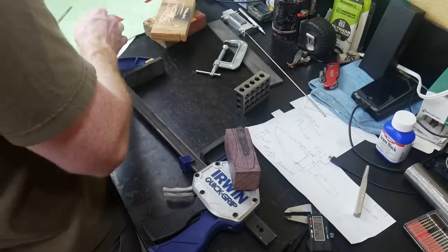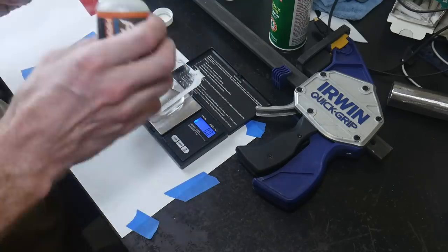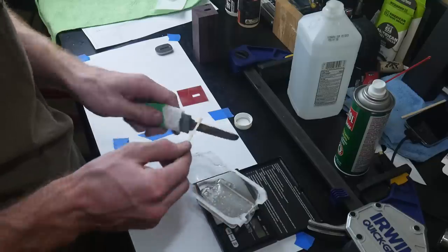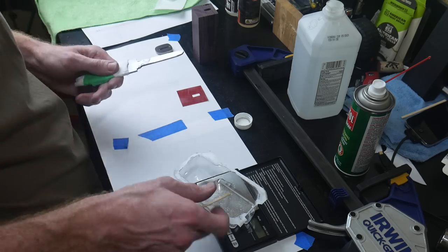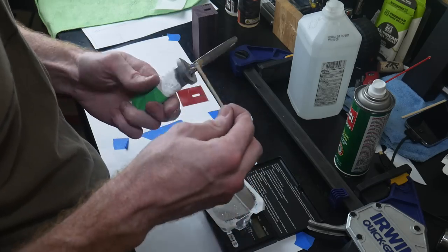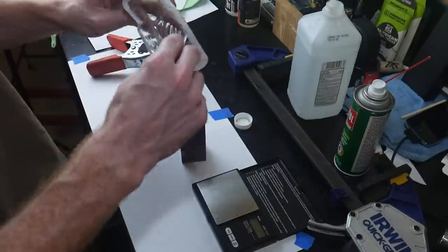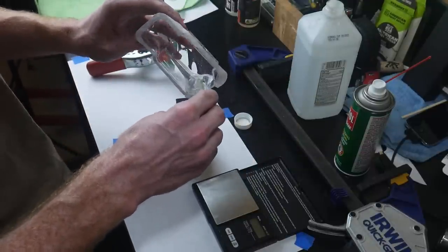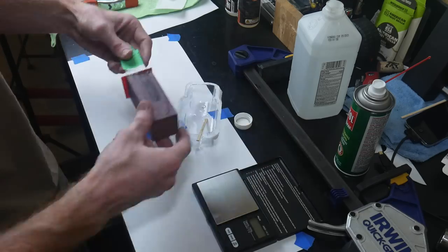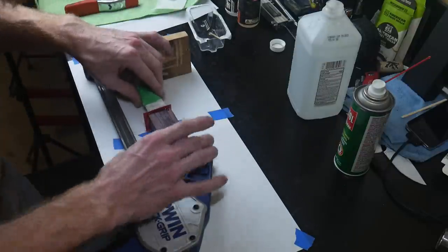I made sure that the front of the handle material is flat and then test fit the whole assembly so I'm not running into any surprises during the glue up. For the glue up, first make sure all of your surfaces are clean — I'm using alcohol; you don't want any oils to affect the adhesion of the epoxy. I put a little bit of epoxy on the tang, slide the guard on, then add a G10 spacer between the guard and the handle material — just because I thought it would look cool. I poured the rest of my epoxy into the handle slot and slowly forced the tang in to make sure any air bubbles come out, then clamped it up straight.